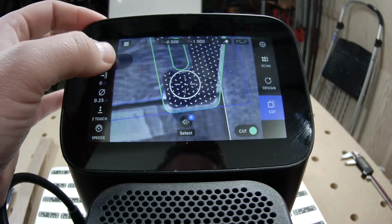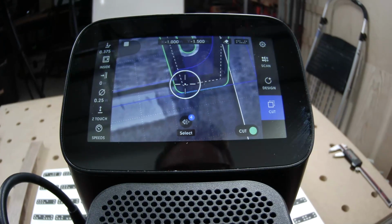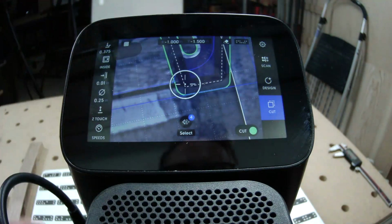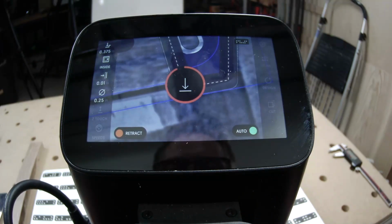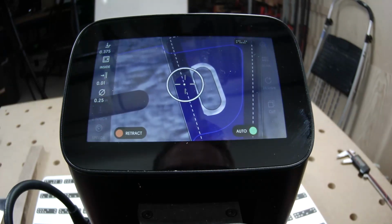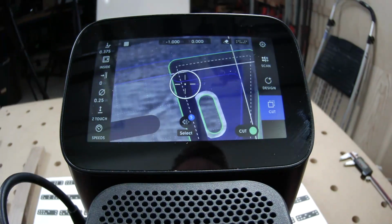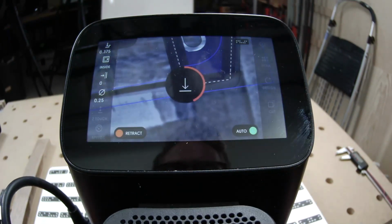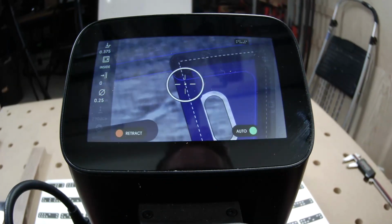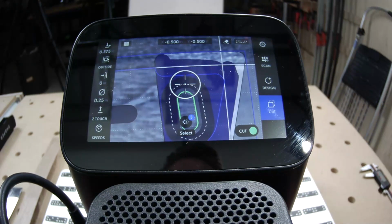What pocketing does is allows you to clear out a big area without having to worry about the offsets, because the offsets are built in for you. That offset is about half the diameter of your router bit. So pocketing with a 1/4 inch router bit, you get a built-in 1/8 inch offset. And then when you switch that to an inside cut, which I think is what Jake just did there, then you get to go in and just trim off that 1/8 inch offset and leave your nice finish pass. I think we're doing, yep, part of the joint there, the nice edge.